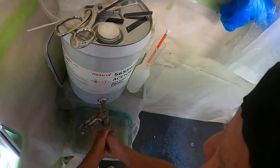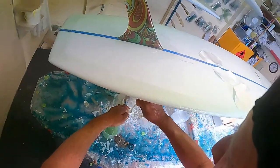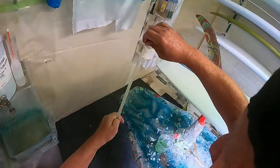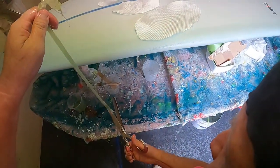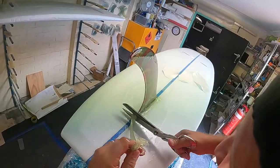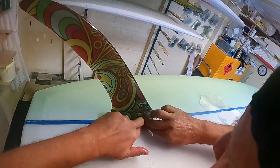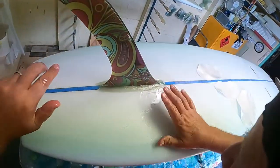Now strain and get my rovings out — it's been soaking for a long time. Pull the resin out like that, pretty simple. You see people going overboard with how many times they pull the rovings through — about four is enough. There's nothing hard about this. This is the way all glassers did it in the eighties, or even the seventies. You grab the end of the scissors, sit it where you want it, and you cut it. There's nothing mystical about this, it's just simple logic.